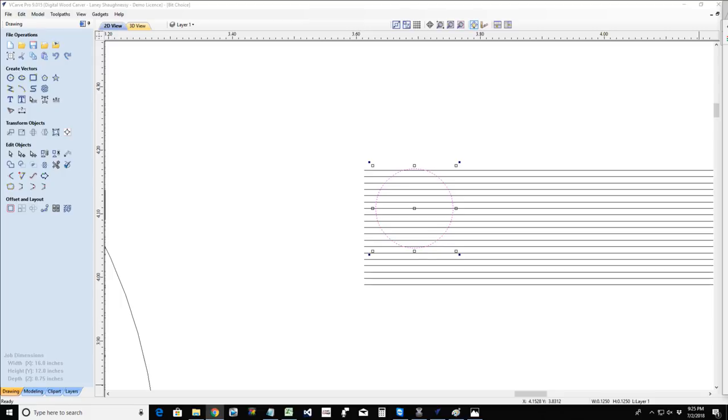So all of these things, down the road, you could be happy with just saying, you know what, I'm just going to use the feed and speed chart that Laney provided in the Facebook group, leave it at that. But that's just a recommendation, guys. That's not set in stone. You really want to start thinking about the more technical things: the proper RPMs for your bit, the proper feed rate and plunge rate, your chip load, getting that optimal cut.